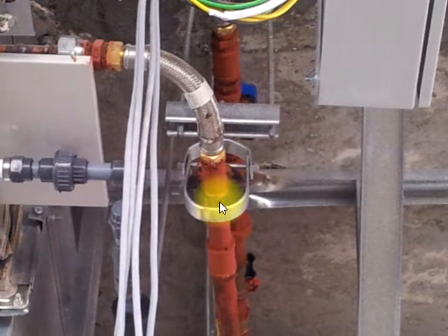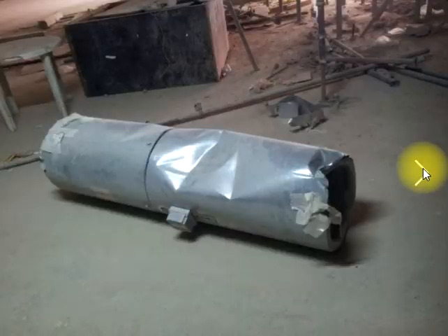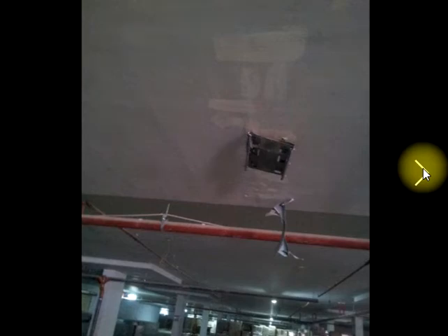The insulation will be done later on, so right now it is not insulated. This is the anchor — because there is a pipe inside, it cannot hang directly to the wall, so they make a chamber and then hang it. This is okay, but the gap in the rubber with this pipe is not acceptable. Next picture: this is a jet fan that was broken by a vehicle.